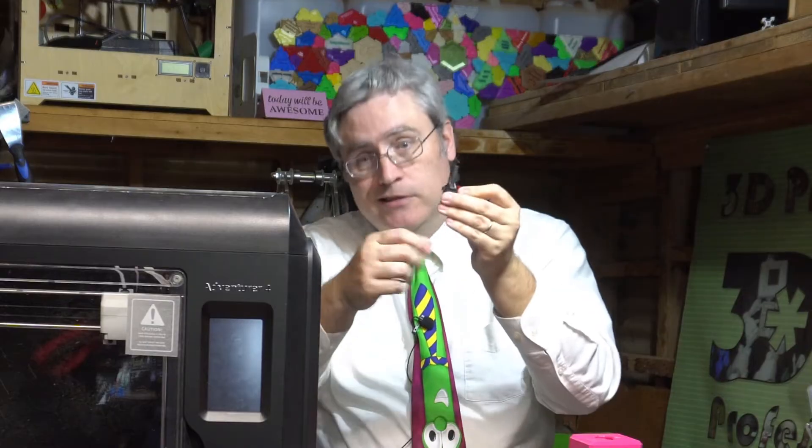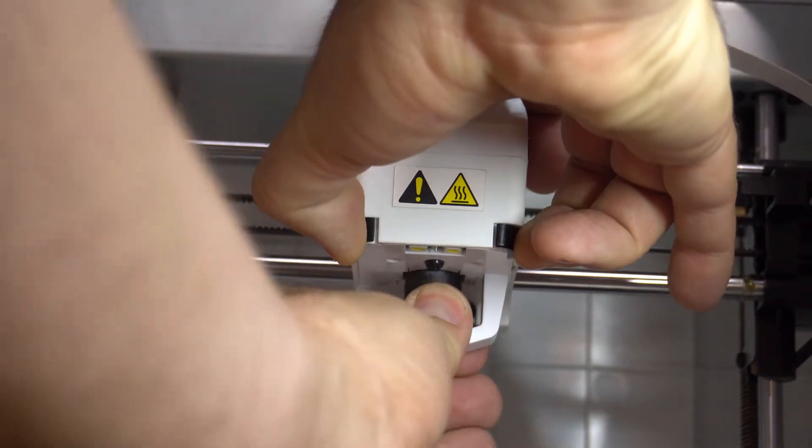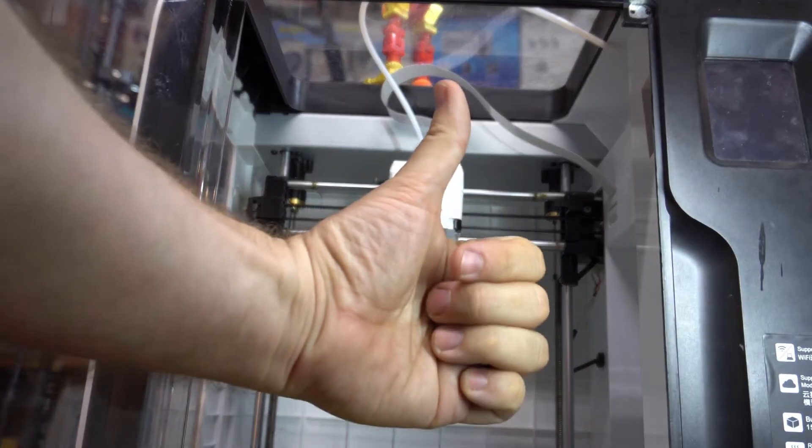One of the upgrades they've added is a new high-temp nozzle. The Adventurer 3 had this really cool nozzle system. If you've used a 3D printer for any length of time, you know the biggest problem is the nozzles — they clog and you've got to replace them, unscrew them, heat it up. Pain in the neck. This solves that. All you have to do is push two little knobs, pop the nozzle out, pop a new nozzle in, and you're good to go. I love these nozzles and honestly you don't have to change them that often. I've used a dozen Adventurer 3s over the past couple of years and I've run through maybe six nozzles on all of them. That's pretty good!